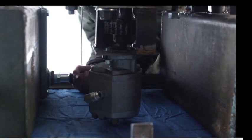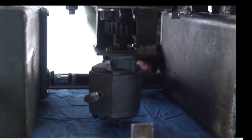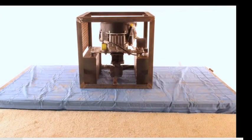And then you've got a suction hose on one side, so you connect that to the hydraulic reservoir. You want it to be fat so you don't have any resistance, because it's not under pressure, it's like trying to pull it through there, so you want it to be a nice volume. It's a 1-inch hose typically that we use.